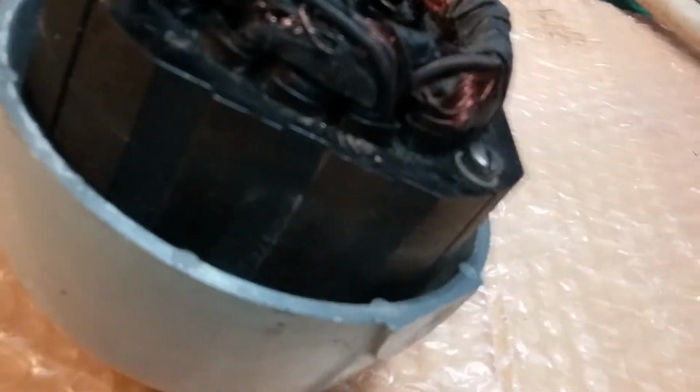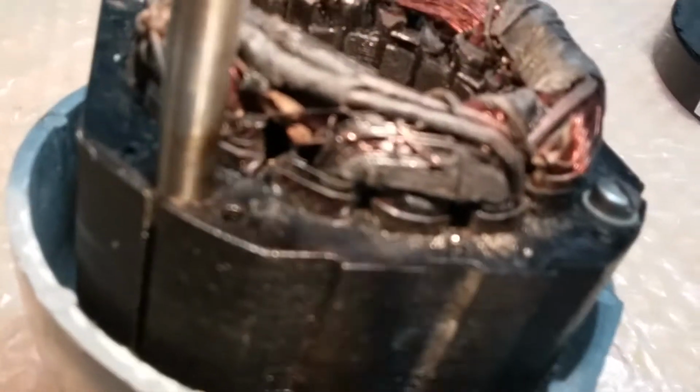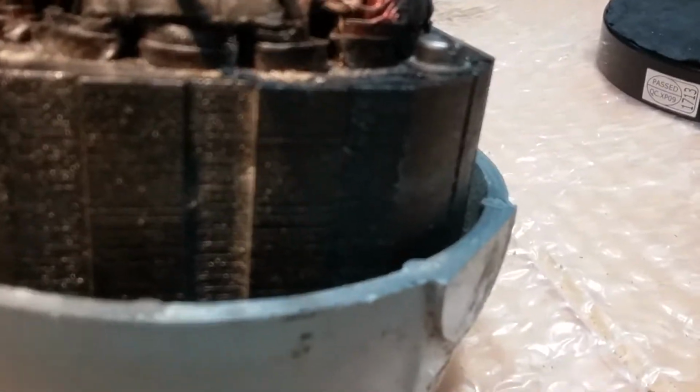Alright, I just disconnected the camera so I can show you this. Let me get a light over here. Another customer I gotta give bad news to. Look in there. Hold on, let's get this light better. Okay. Do you see? Let me get a pointer. Okay. This is where the fire in the hole was. You see those big knobby round things? That's melted copper. Melted copper, and that's where it busted free. And it melted so bad that it melted a bunch of copper around it, and it overheated this whole coil.